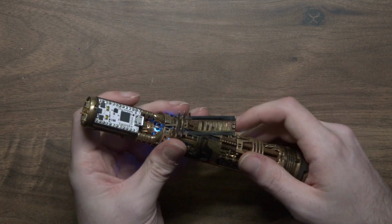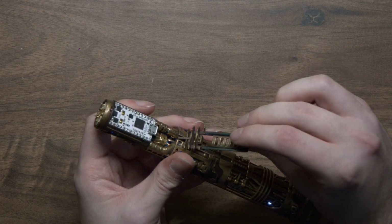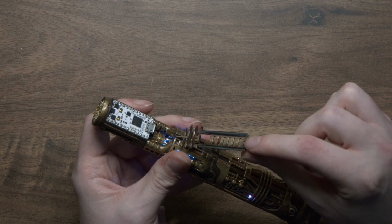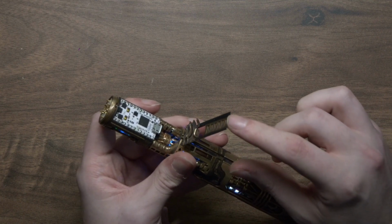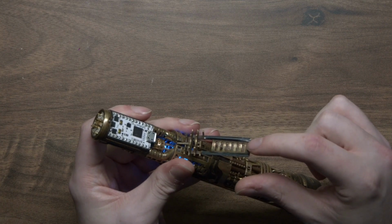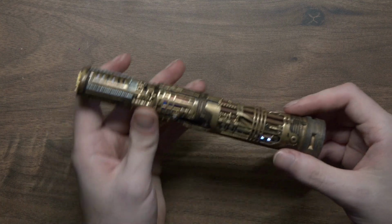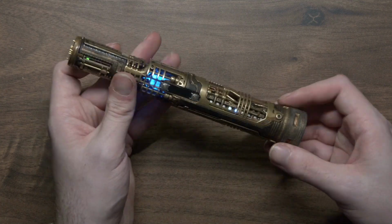It's worth noting, by the way, John, that this little cover has some insulation just above here. It can sometimes slide off. So just be wary of when you're putting this little flap back down over the Proffieboard that these haven't moved over to the edge. Or even, just don't lift it up at all, that works just as well.